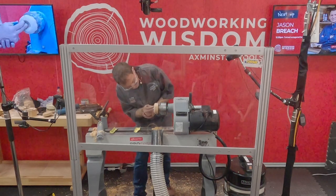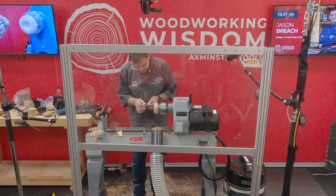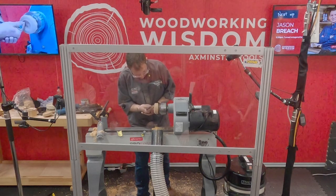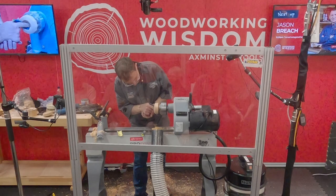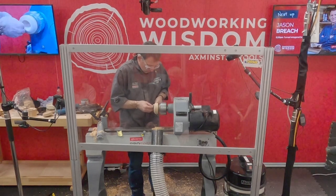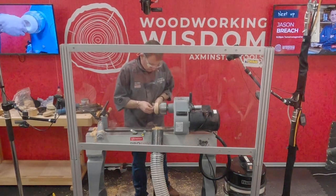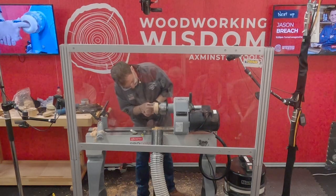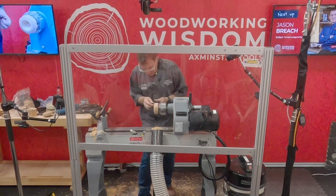Using a piece of cherry. You can see the two hands working together to support this. Fingertips tell you what's going on. Back out to the edge — 240 grit abrasive, then 400. We're nice and high speed for the outside. Drop it down to about 700 again for the inside. Keep the abrasive moving.